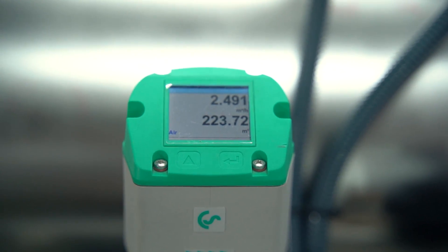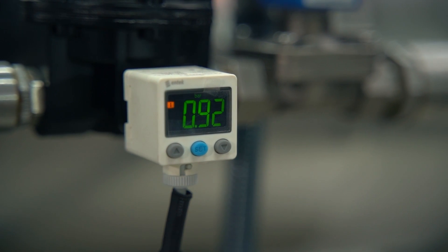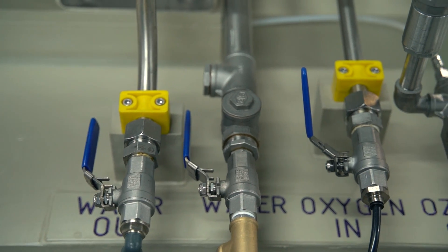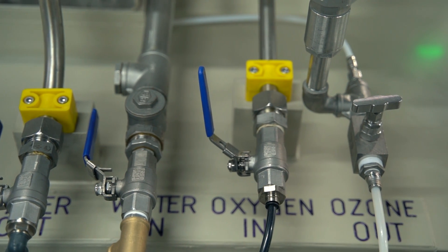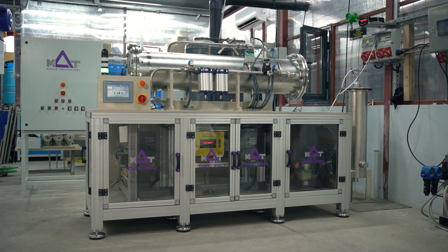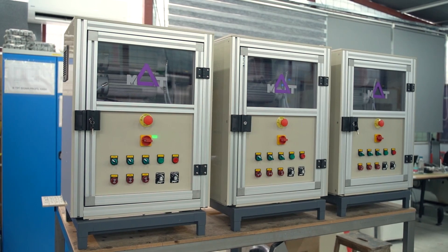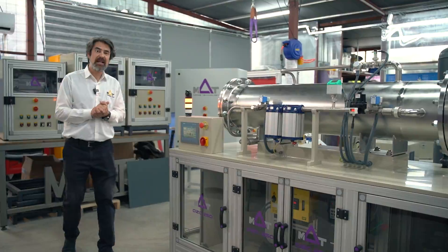This is the base of the ozone generators where we need to install or connect the oxygen flow and chilled water for cooling. It's also possible to combine all of them together, and it becomes a complete skid which includes the ozone generator, water chiller, and oxygen generator — all as a single package inside a single skid. But it's also possible to go only with the generator, or generator plus another unit. MUT's custom production and design is open to all of these selections. Thanks for watching.